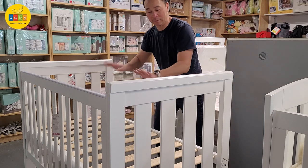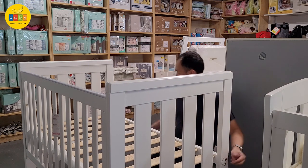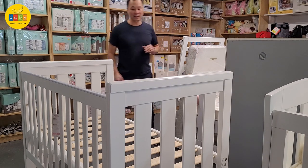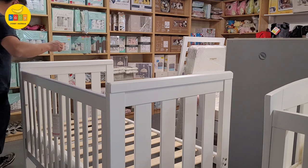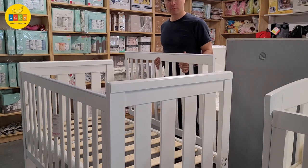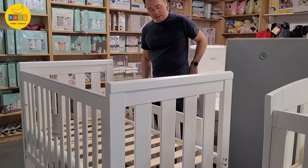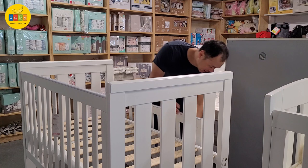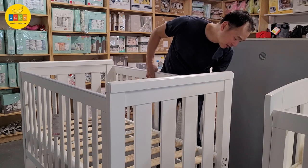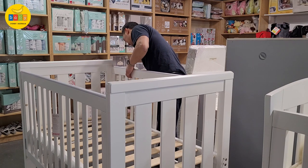With that, I'm able to lift the base all up. Now it's horizontal, all I have to do is tighten the screws. Once you tighten all the base screws, all you need to do is the other end. To put that in, I like to preload these ones. It just makes life a lot easier. So the screws are all preloaded. All I need to do now is align it to the hole and lightly turn it to get it in.